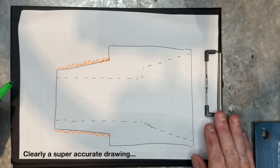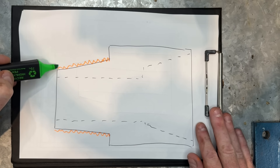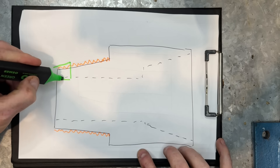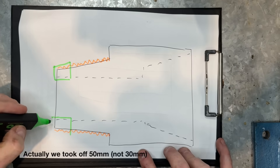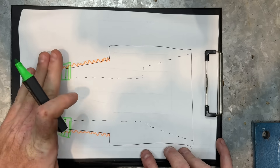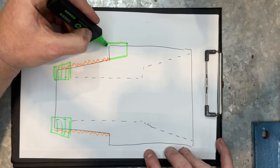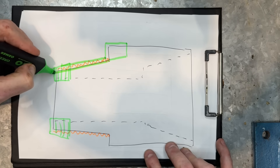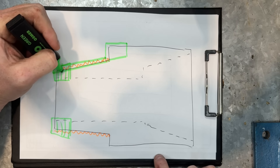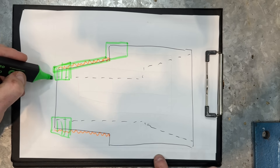Just so you can get a feel for what we're going to do in the CNC — these are the threads here that have been destroyed by Robbo on the big rig. What I'm going to have to do, because they're now too low and they've lost the actual thread height, is take off about 30mm of the nose here with a CNC program. This is a void up the center, so I'm just going to write a program to take off this part here, which is then going to leave me with a shortened saver sub. The second part of the program is just taking this part here off so that I can have a nice top of the thread brought back to being bare material.